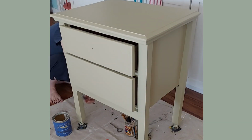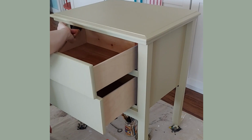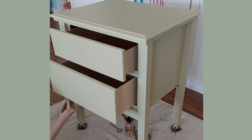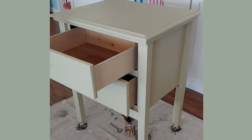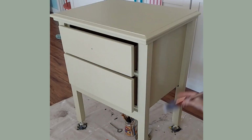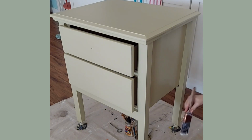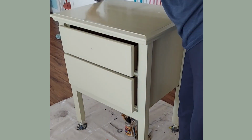The only thing I had left to do after all of that was a coat of top coat. I'm using General Finishes Flat Out Flat, which is one of my favorite flat top coats. And I'm only doing one coat because set coat actually dries with an almost enamel finish, so this top coat is probably overkill to begin with, but this gets daily use, so I figured better safe than sorry. Once I wrapped this, I could get the hardware installed.